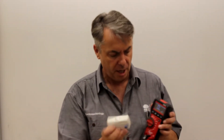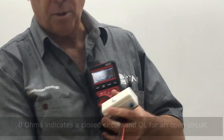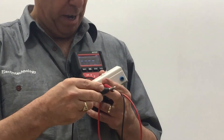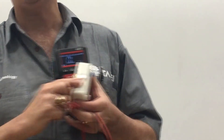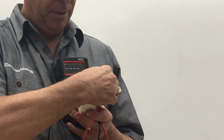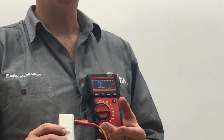You're going to be using a switch in your practicals, so we're going to test the switch. A switch is just either open or closed — just like touching these two cables together gives a reading, and opening them creates an open circuit. The switch has three terminals. To test it, plug one lead into one terminal and another into a second terminal. With the switch in one position, it reads zero ohms. If we flick the switch, it should say OL, indicating an open circuit.